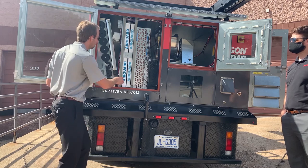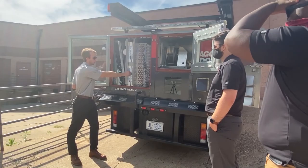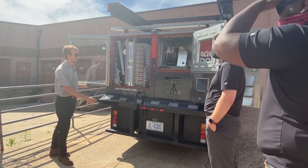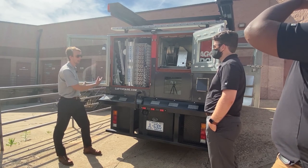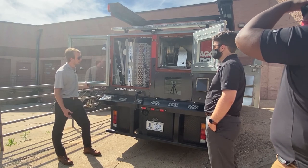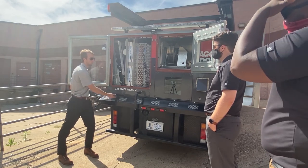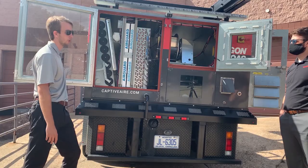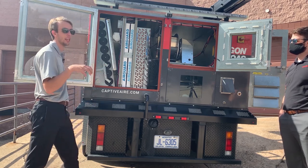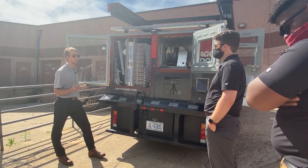We have further filtering — four inches of filters that can be placed into the unit. Currently we have a MERV 8 and a MERV 13. This could be replaced with a four-inch HEPA filter or a four-inch MERV 15 filter if needed. We can outfit this unit with any filtration the customer requires. With our return, when using an ERV or powered exhaust, we can add additional filtration to the return as well. We always use it with the energy recovery wheel to protect it from particulate clogging and maintain max efficiency.